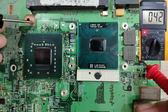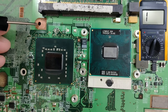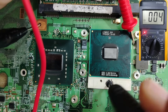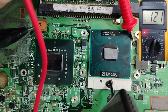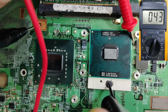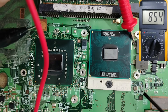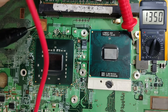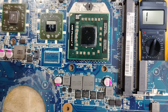Let's check back — we have a low rating. I can make it easy for you: if I open (remove) the CPU, we get a high rating; if I close (install) the CPU, we get a low rating. Open — high; close — low. This means it is NOT a short circuit. The low reading is from the CPU, not a short.